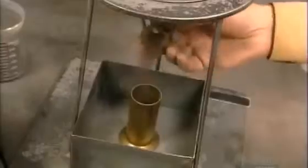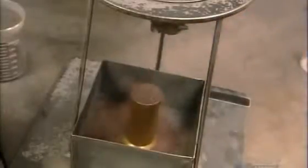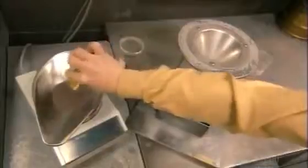To find out how the coarse abrasives shape up, they funnel them into a cup. Then they weigh the grains. A higher weight means they're densely stacked and therefore blockish in shape with blunt edges. A lower weight means they're flat and sharp.